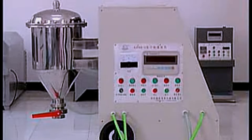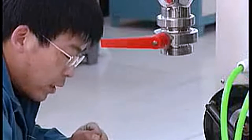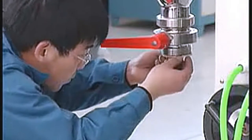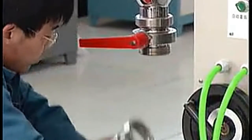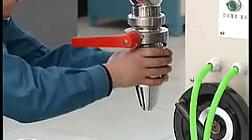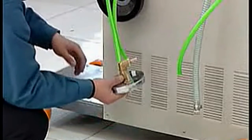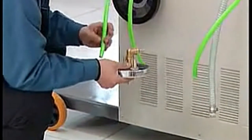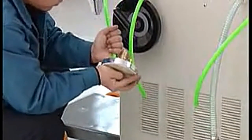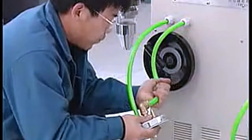This model processes both manual and automatic filling functions. Manual filling procedure: turn the filling button to filling state. Fix the powder discharge outlet, putting a hermetic washer inside and then fasten it. Fix the powder injection capsule. Fix the powder suction pipe for 1–8 kg.